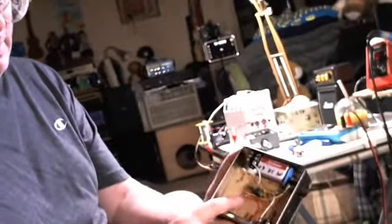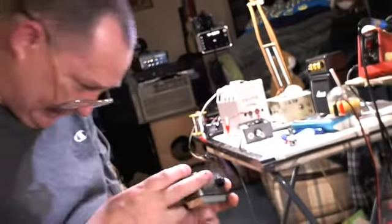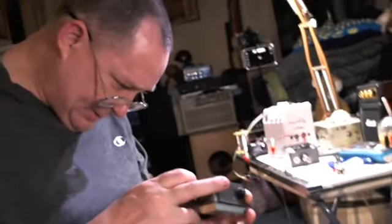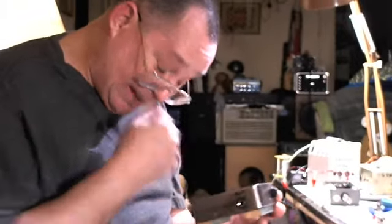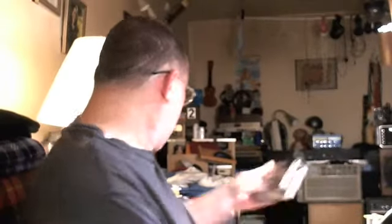This is the one I had initially built. It's got a 9-volt battery, it's mounted on some cardboard. It's a simple circuit — two resistors, two electrolytic capacitors, a poly cap, and then the TL072 op amp. Pretty basic. I'm sure it works, it's just a couple of times in testing it was giving me some guff.